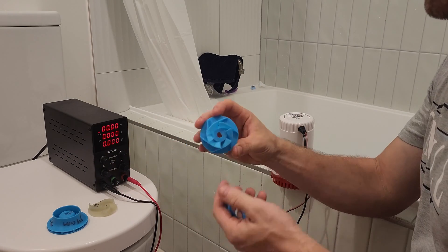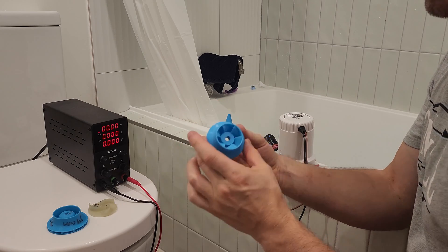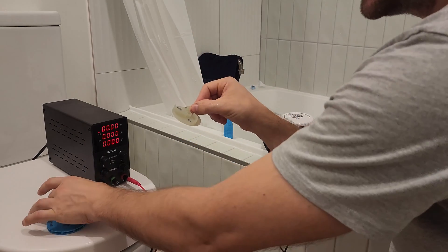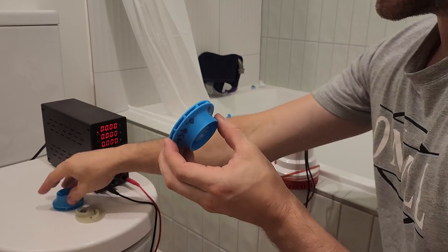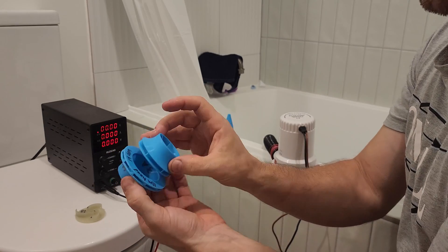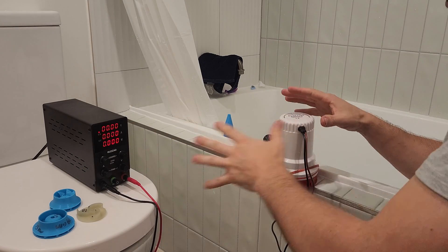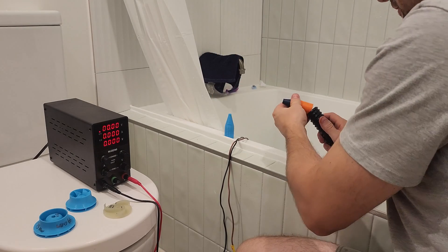This 3D printed impeller has nice blade shaping and I've set it up to predict the same performance as the stock one, just hopefully more efficient. The next test impeller has a narrower edge so less water flows out, but it's a larger diameter so I should get higher pressure. I've got the low-pressure version meant to match the stock but more efficient — let's see how it goes. Let's get ahead to an eight-millimeter nozzle here.